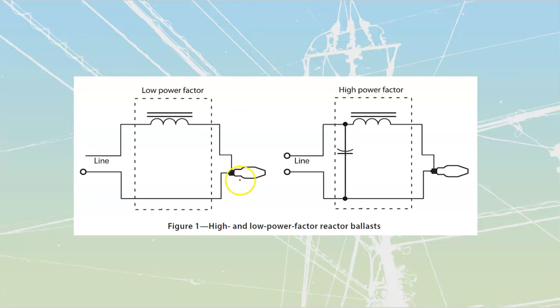If you take a look inside of this lamp, we know that we are going to have an arc that's going to get struck across the arc tube. So I'm just going to draw that through here. There's my arc coming back and through like that. And when we take a look at that, we see that that is going to be my path for current. So wherever my current is entering in, it's AC, so it's going to be switching back and forth, I'm going to be sending current through here.